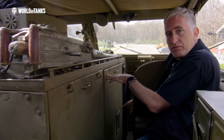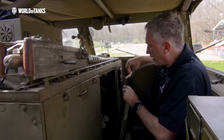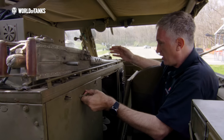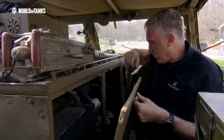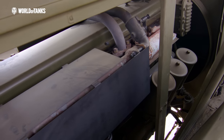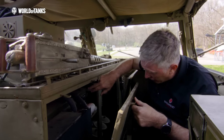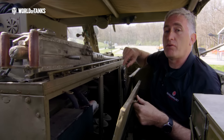The engine is shielded by panels with a louver for the heating system — it just lets radiated air from the engine come out, pushed by the radiator fan, and shoves it out the little vent to warm the cab. On the right-hand side of the engine you have three oil filters, an oil cooler radiator up front, exhaust behind the heat shield, starter motor down below, and piping for the carburetor preheater.